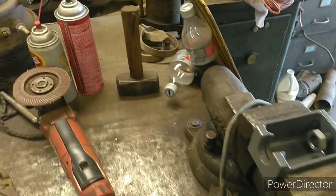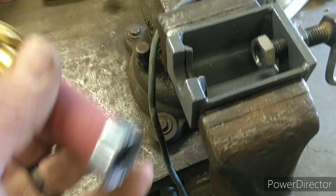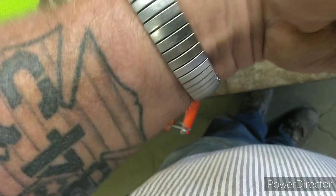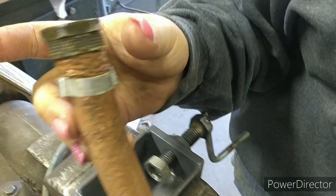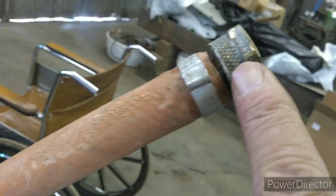This is our hose press. These are the pieces we use — 5/8 hose. I don't even know what that crimp ring is actually sized for, but that's the size that works. I got a slug I put in the end so we're not screwing up. That's a male end so you're pushing on it. The one I just showed you was a bit ugly — they pressed it on a little farther. That's the one I cut off. When I pressed it on, it buggered up a little more. So on that end we just pressed it on a little bit more, which put it in the hose farther.